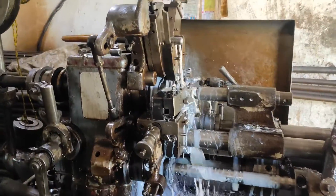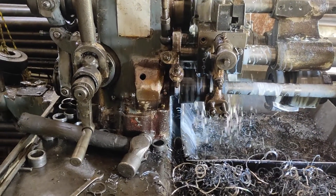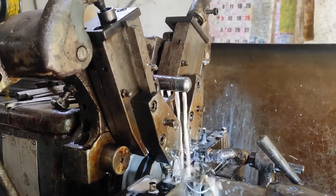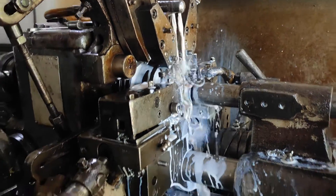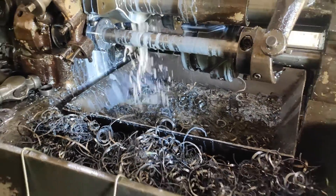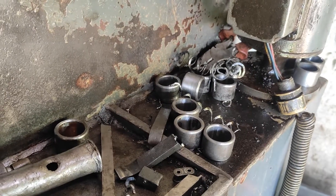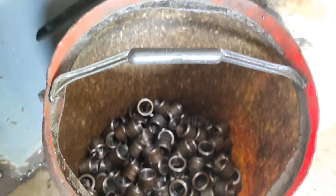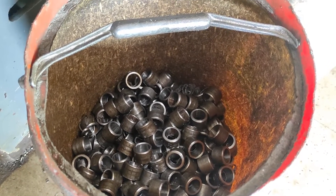Here we start — there are five heads present in this machine, meaning five tools can be mounted. Processes such as chamfering, turning, slicing, as well as facing jobs can be done easily on this machine. The machine looks complex but it's sturdy, cost-effective, and precise. It is simply based on the cam system.